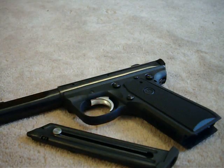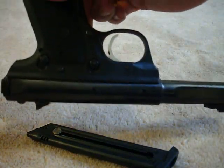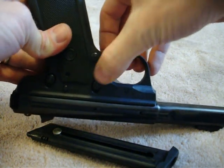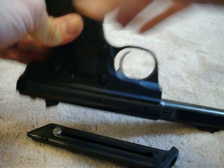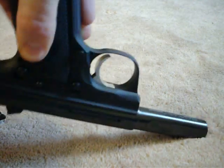Here's the gun reassembled with that spring installed. I'll show you that now when the gun is upside down, that lever will not fall up — you see? That spring is forcing it back to the down position so the gun will no longer lock the bolt back when inverted.